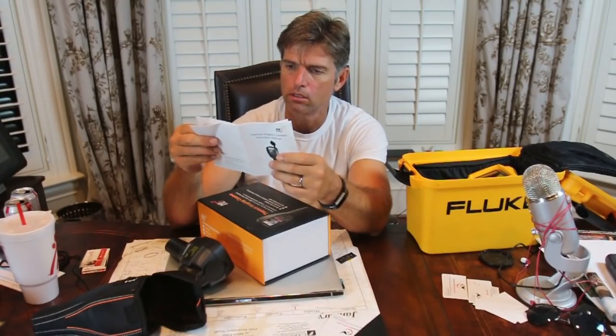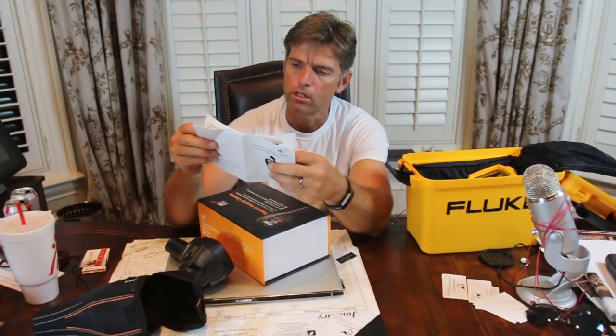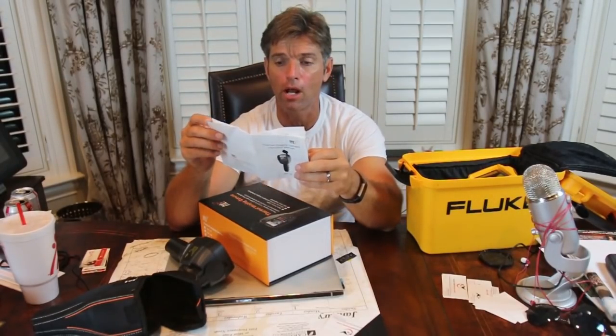You can change the color modes — you've got that rainbow color mode, black and white, and you've got the iron. I prefer the iron. You can set the temperature range from the hottest to the coolest and everything in between. But if you really want to micro-analyze something, you can create a smaller temperature range and it'll really micro-analyze the temperature difference. Because obviously when you're doing infrared, you're looking for an anomaly — something that is unusually cold or unusually hot for some reason. Anyway, let's go check it out in the field.